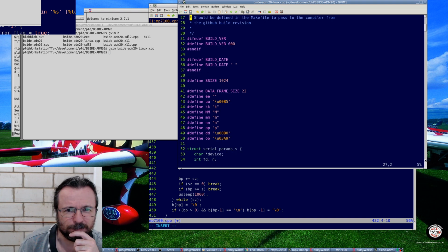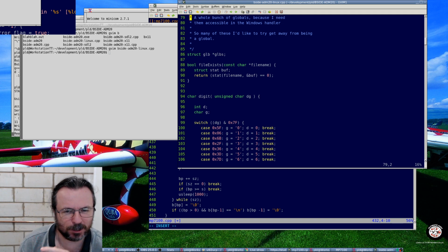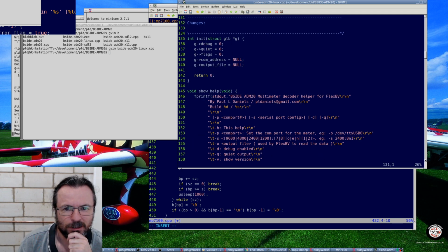There's no mention of that. And even if it was the case, it's already responding. The power supply is already responding. It's just that I'm not reading it correctly. And I think it's because it's timing out, just waiting for the buffer to get beyond a certain size. I need to read this in a character at a time.